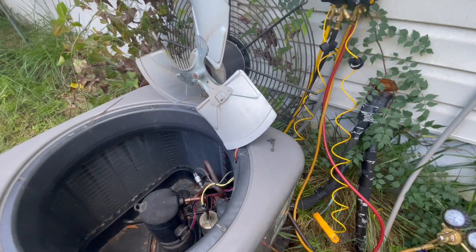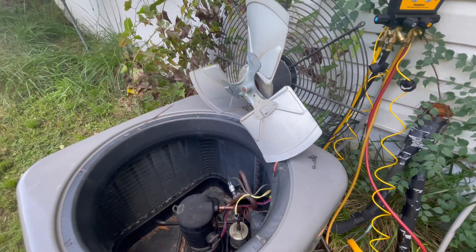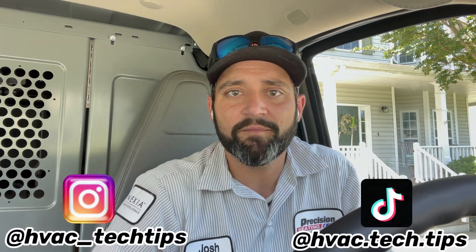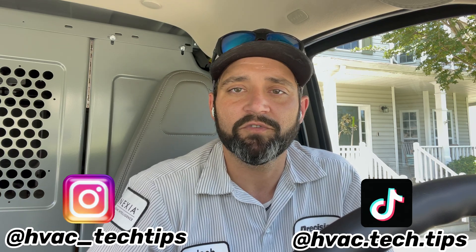I'm going to get the vacuum over here, get it vacuumed good, get it down to 500 microns — try to get a little lower but the time frame is starting to slim up. We'll get started on this vacuum and fill it up with refrigerant. We got the leak fixed, the pressures held perfectly, never really rose or fell. I also wanted to give a quick thank you to all of my subscribers — I've had a lot of new subscribers lately and I appreciate it so much. Check out HVAC Tech Tips on Instagram and TikTok. Some videos will be posted there that aren't going to YouTube, so follow me on all three. Really appreciate y'all — we'll see you at the next video.